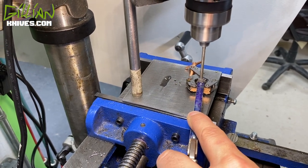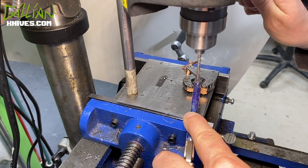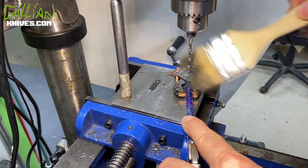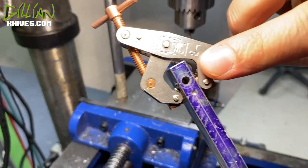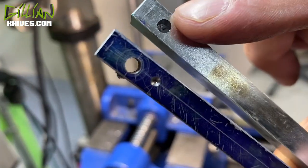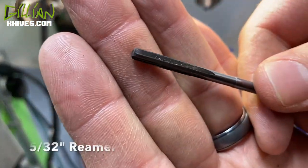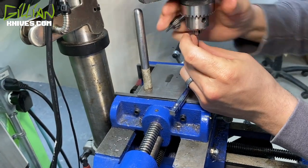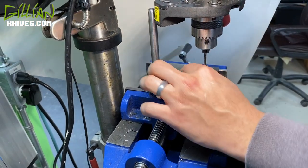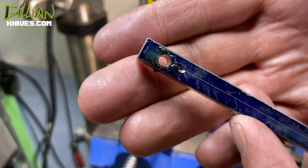It's exactly 90 degrees. You can see the number 25 hole. I will now ream this hole. I now will ream this hole with a 5/32nd reamer so we can now take these apart. You see I did not drill all the way through the second half. I will now ream this hole. This is a 5/32nd straight flute reamer. I have now reamed this hole.